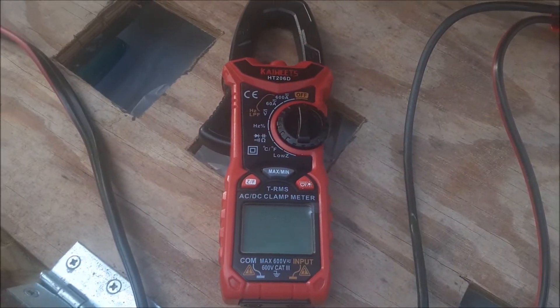I just want to get kind of a base reading. This is for the motor that left me out in the middle — or almost dead — you know, battery kind of went dead on me. The boat ran on speed three forward from two to eight PM and the battery only dropped to 58, so I'm thinking maybe it's drawing too many amps.